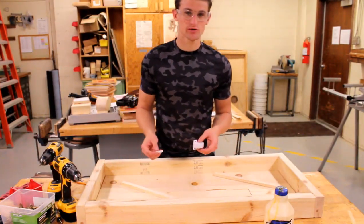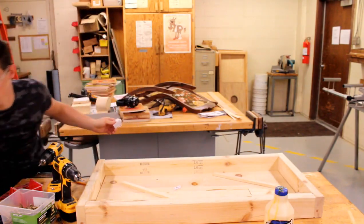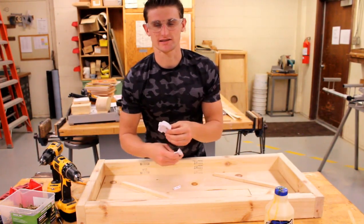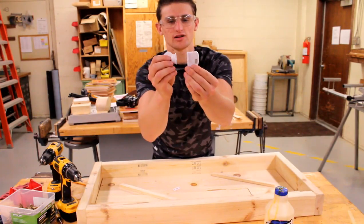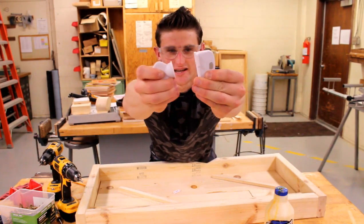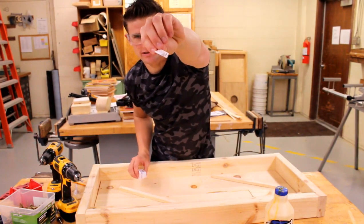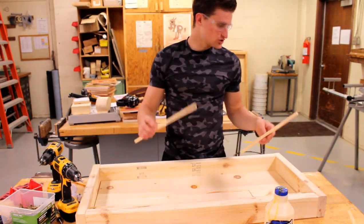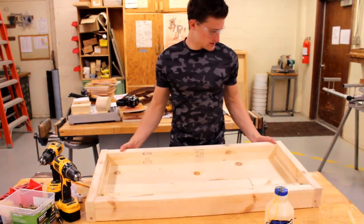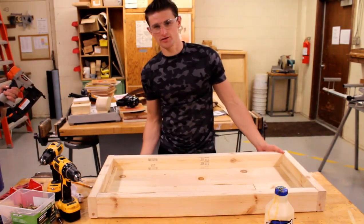The way we're going to lock this mechanism is we're going to use these kind of like baby-proofing magnet locks. The way they work is these go on the inside of whatever it is you're trying to keep out of a child's reach — in this case, a burglar or whatever you want. When you make it close, the locking mechanism comes in and allows you to get in. It's going to be mounted next to this ramp which will stop it. We've got these two pieces that'll go right on the sides of the cavity and help us maintain a flush bottom from the outside.